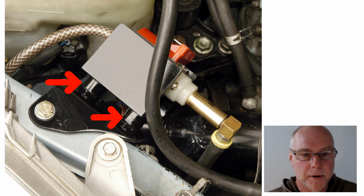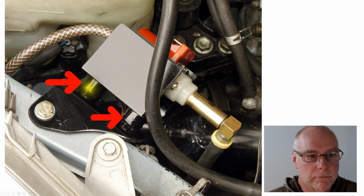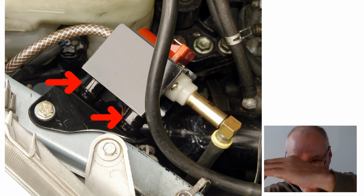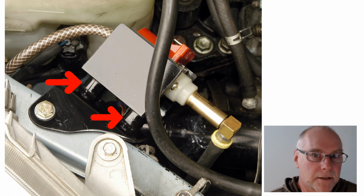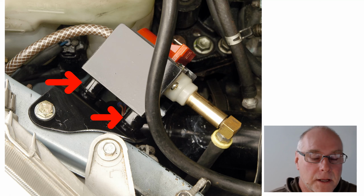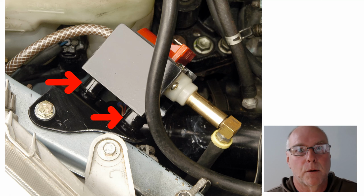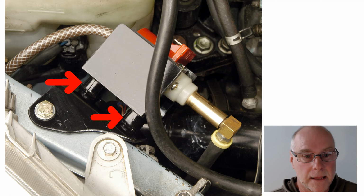And here's an example of that pump. Here's the intercooler water spray pump, the 50 hertz forcing frequency, and I don't know if you can see from that angle, but I've used these normal cotton reel rubber mounts, but I've put them so that the mounts are not underneath the pump, they're to one side of the pump, and so it's like that. The pump is bending the mounts downwards, and so the static deflection is much, much greater. And with this particular pump connected to the bodywork of the car, as you can see there, it was vastly quieter with the mounts organised in that way, because the static deflection was so much higher than if you had the mounts directly underneath the pump.